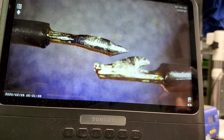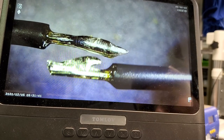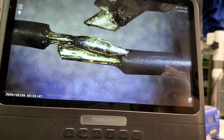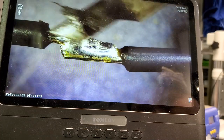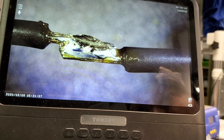Now is the important part. We're going to put these two wires exactly where they need to be and I'm going to show you what happens when we melt and bond them together. Right there they're next to each other — put the iron on one, it bonds with the other, and you can see how I move my iron from side to side. Take a look at that connection.